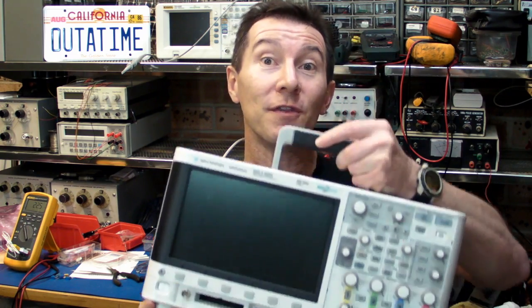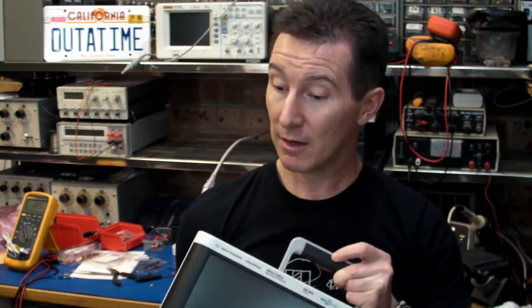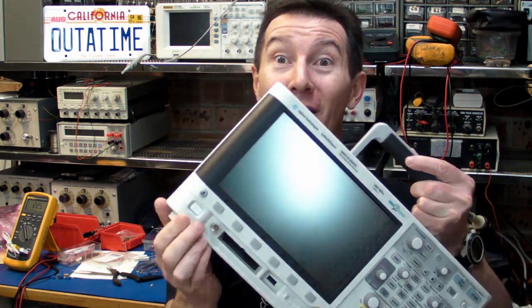You remember a couple of months back I reviewed these new Agilent scopes and how groovy I thought they were. Now, a couple of days ago, a person by the name of Rufus on the EEVblog forum noticed that his one, when it was turned off, was still a little bit warm. He measured the standby power consumption and, to his surprise and mine, it wasn't zero. He measured about six watts or something like that standby power consumption.